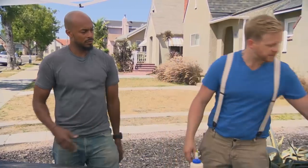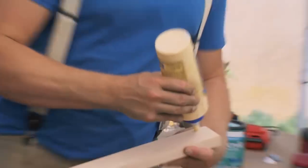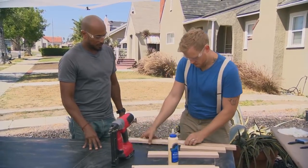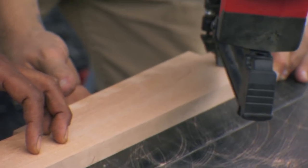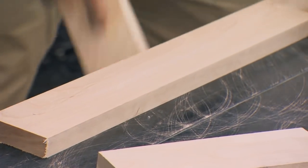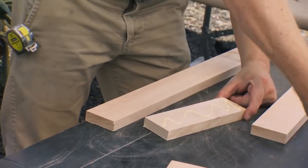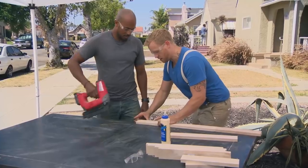Let's get gluing and nailing. We'll put our safety glasses on and then we're ready to get started. First board is always going to be the hardest. We'll start with a little bit of glue on the back. Make sure that it's really flush to both of our edges and our corner. Then we'll come through with our nail gun, tap it into place at least twice, and then keep working our way down. The best thing about cutting all of these random lengths — we don't have to worry about mapping everything out and being really precise. We can kind of just see whatever feels nice.